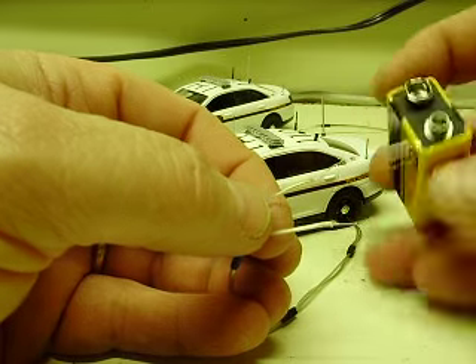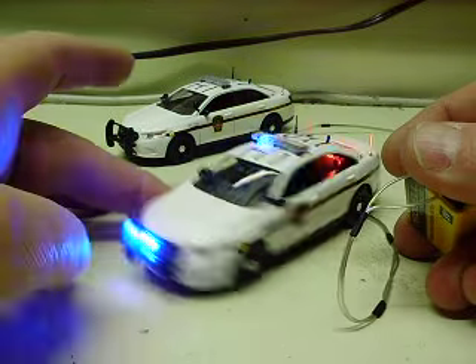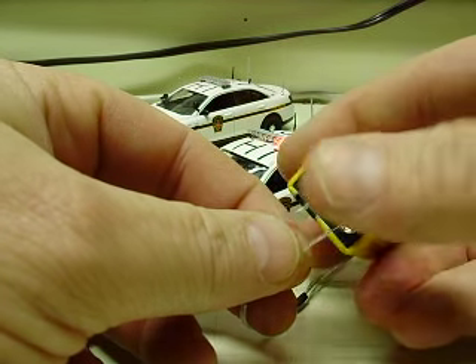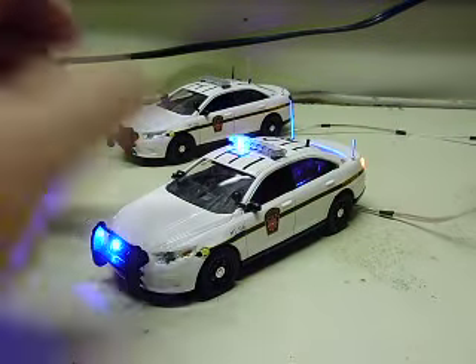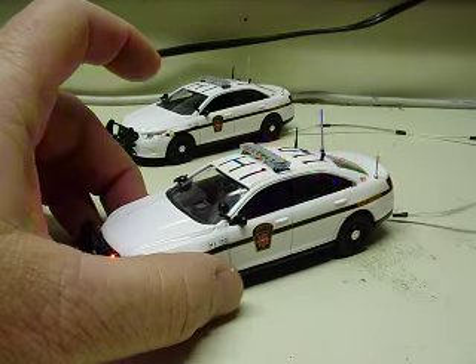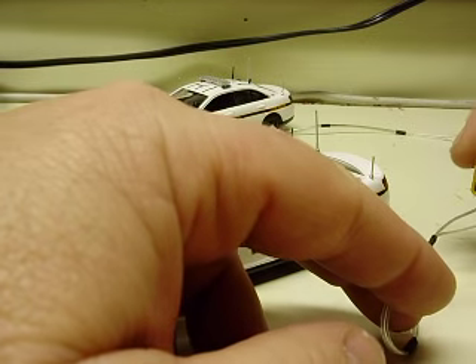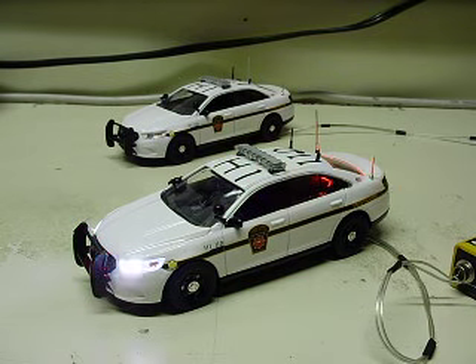The wires aren't marked, and you know why? Because it doesn't matter which way you hook these up — they're going to AC. I know I'm not some kind of magic man that defies the laws of electricity. It's done with a device called a bridge rectifier. I know some of you have asked how you hook them up to a train layout when it's AC, because obviously DC is what LEDs use. So it's called a bridge rectifier.